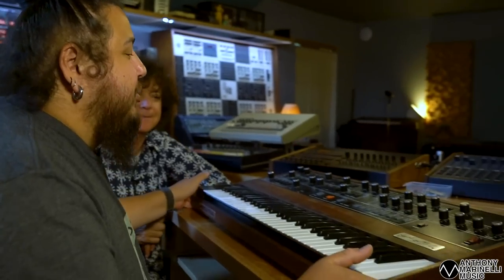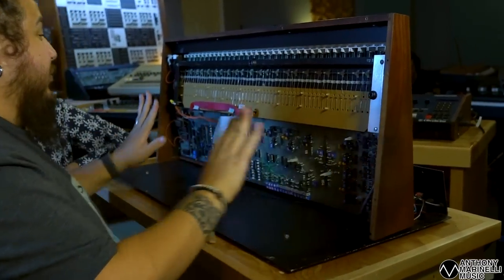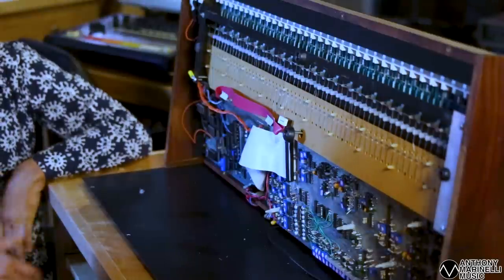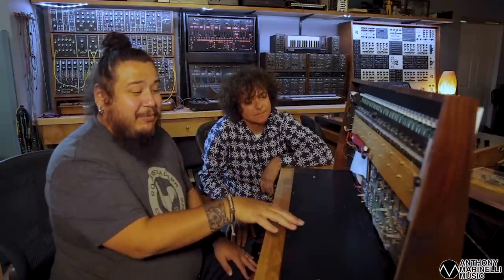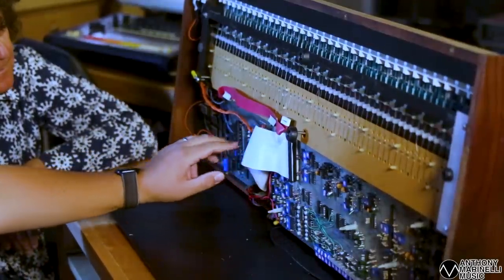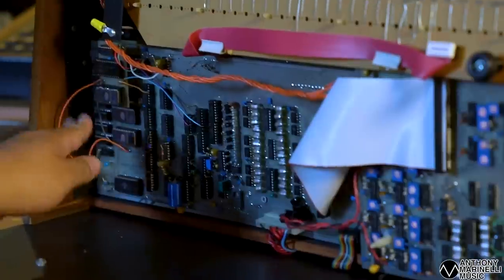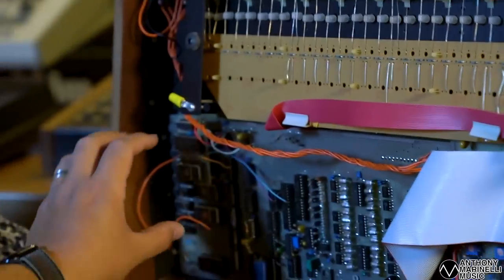The unveiling - I'll show you how miles of wire gets condensed into a couple ribbons. Starting over here you have your Z80, which is nicely tucked under this board that has to do with autotune, because these synths actually fully calibrate themselves - well, not fully, just the oscillators. On a Rev 1 you have to press 1 and 8 at the same time to make it tune itself, and it'll automatically calibrate the oscillators and bring it as close to in tune as possible.